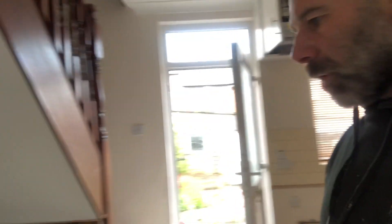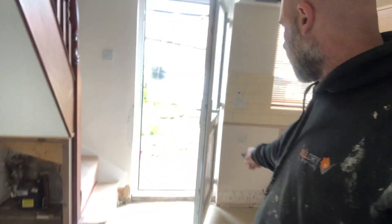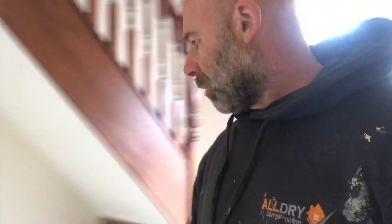I've prepped it so I'm putting my thing out there. One of the things I have done: we fitted this floor and we put subfloor vents in. But what I like to do, I always seal around the edge of the floor, because you've got cold air running underneath. I always form it all the way around the edge — the water and draft isn't coming through, there's plenty of air going through there. Seal it all the way around, make sure there's no cold drafts coming up and you're not getting that cold bridge in.